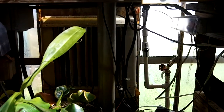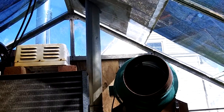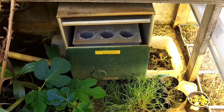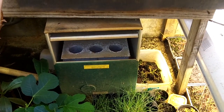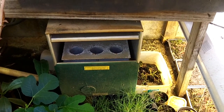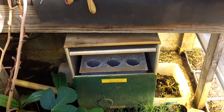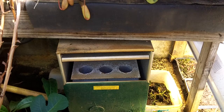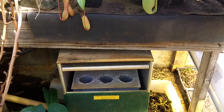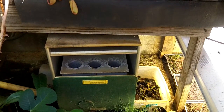So we just covered cooling. Heating — have backup systems. Outside we've got the stack of our LP gas furnaces. These are really fail-safes. They're made by Southern Burner Company. We've got two of them, 25,000 BTUs each. They don't need electricity — they use millivolt thermostats, so we have a thermostat on the wall and if it hits your set point, it comes on. No electricity needed. It's convection heating. It works very well, but it's expensive — it's LP. A couple years ago we had a snowstorm and a power outage. Because we had our backup system on, these guys kicked in and saved the day. Otherwise, we would have lost everything. So you absolutely have to have a backup heating system in the greenhouse.